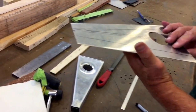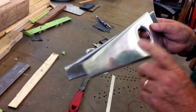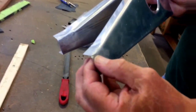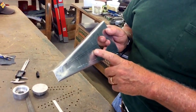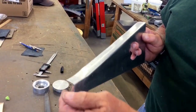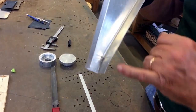We're making one of them, but I have made three of them already. The difficulty is this is a piece of T3 aluminum, and when I was trying to stretch the metal I split it right at that point because the metal was a little too brittle. We thought we could make the turn and then flatten it out, but that one didn't work. The second one was last week — we heat-treated it, and the flatness got a lot better, but right as we made the last bend we ended up cracking it in the break.